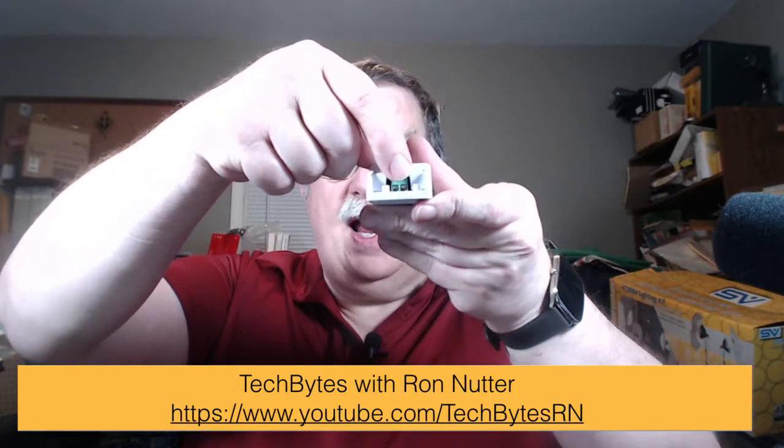Once you've got the wires put in place, you'll have these little covers that go down over the wire — they've got a serrated piece that acts as a strain relief and helps keep the wire from being pulled out. As you're screwing the wires down, make sure you don't have any wires crossing between the two terminals or you're going to have a short. Just be very careful — it's straightforward and easy to do.